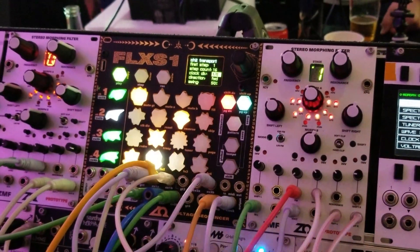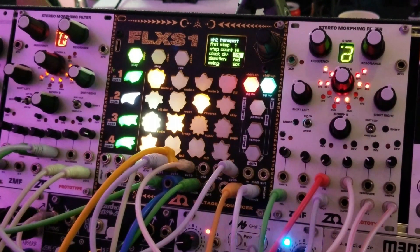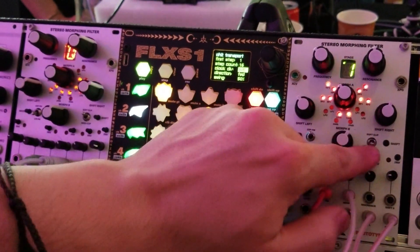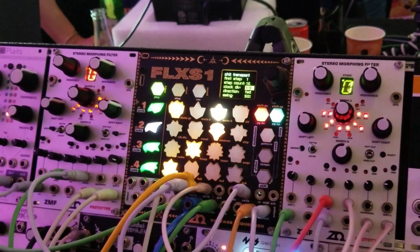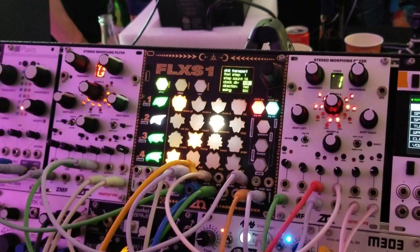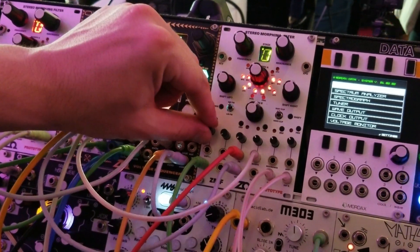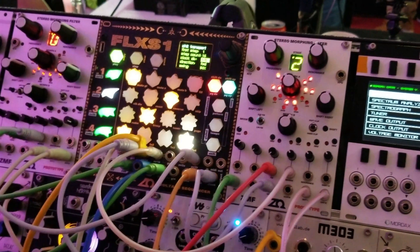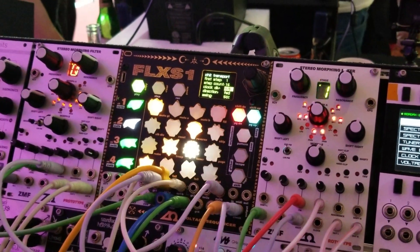It's still a work in progress, about 90% finished. You can control the clipping with a soft clip circuit or turn off the clipping completely — when clipping is off you get serious dynamic range, which is desirable in some circumstances but not others, so there's a soft clip switch. You can also independently control the left and right secondary filters with CV, and it has volt-per-octave tracking. I also have a linear FM circuit and I'm working on implementing through-zero FM functionality for the filter, which is still forthcoming.